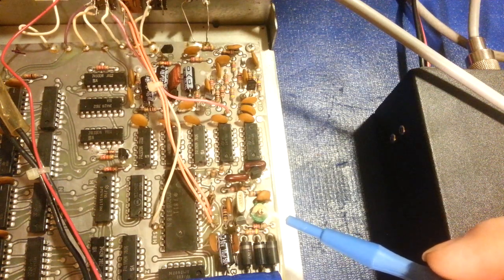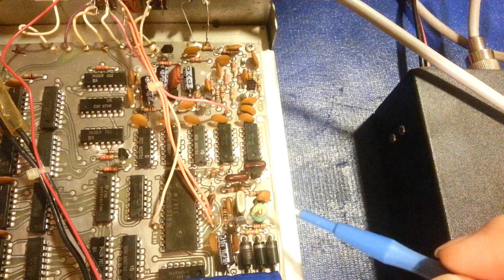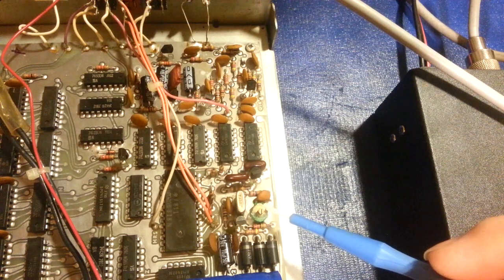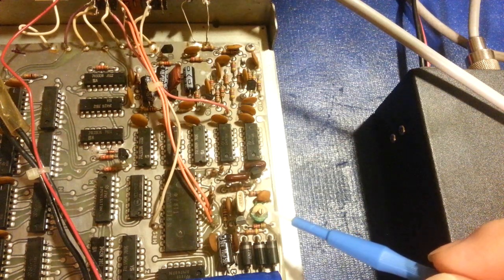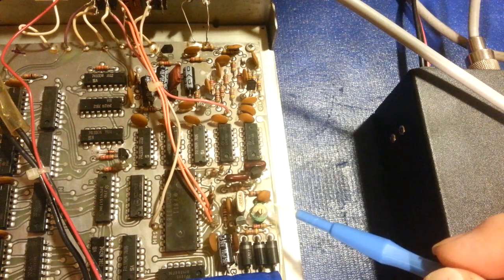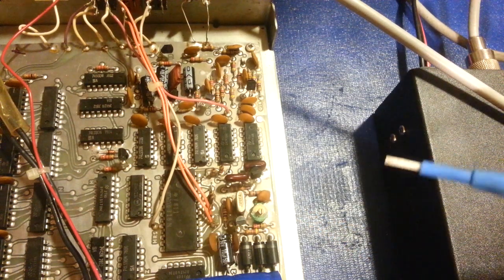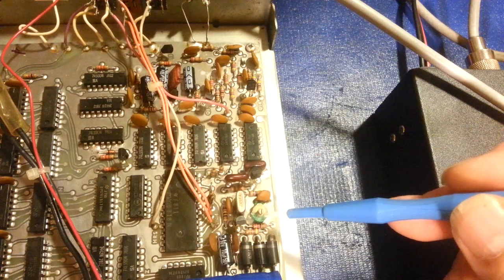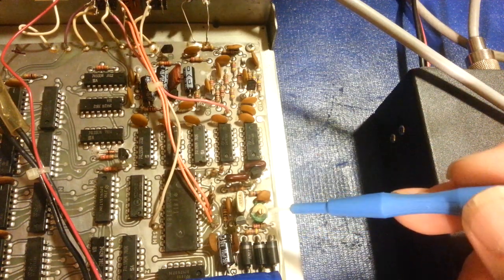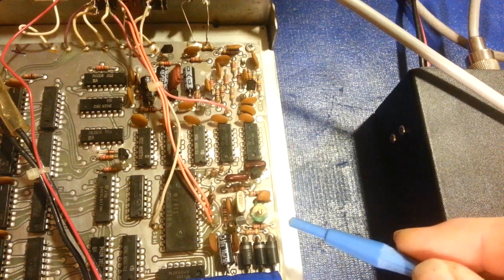If you turn one of these and you see those wafers rip, that's the problem: they're so close together, those mica wafers actually do contact and they're rubbing on those discs. And I think the edge of one of these plates catches and it starts to rip it in half. Now you can save it. If you ever try to calibrate one of these and you see the little wafer starting to shoot out the side, stop. Don't turn it anymore. Push that little wafer back in.